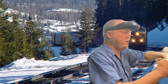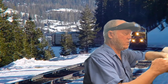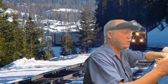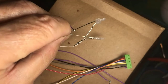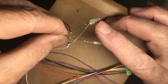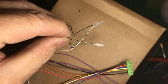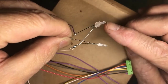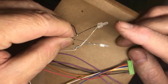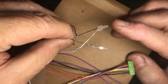If you had two resistors here, let's say they're 5-ohm resistors, the current would come through the 1K resistor, and then the current would share neatly between the two 5-ohm resistors. LEDs don't act like that. One of them would turn on and start conducting and hog all the current, and the other one might not light at all. Or the one could hog the current and burn out, and the other one would then take all the current, and then it would burn out. It would depend on the voltages, currents, and the resistor you had, but they don't share current equally.